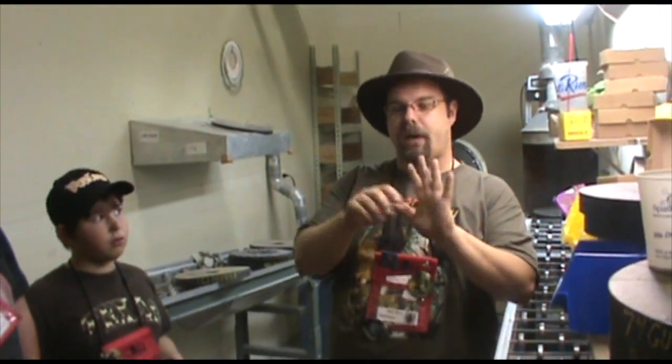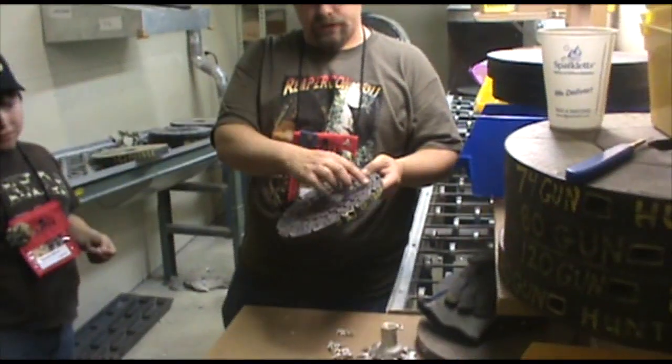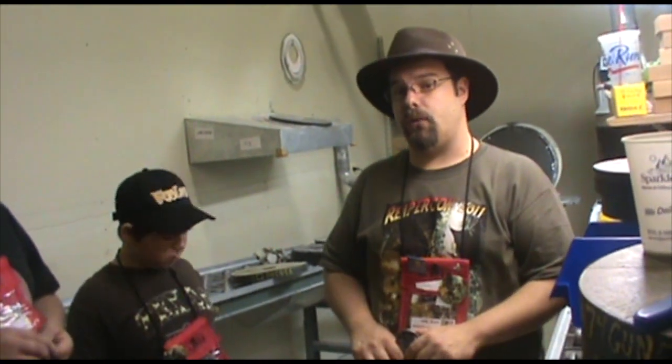He tears up those spikes every time they rip across the rubber. They put a little tear into it, and a little tear into it, and a little tear into it. And over the course of several hundred spins, they'll have successfully torn out a fairly sizable chunk of that rubber. And at that point, you'll notice that he's begun to grow what looks like broccoli on the ends of his spikes. And as soon as we see that, we go, okay, we've got to throw that mold out and make a new one. So a soft figure, I've got molds in here right now that are 20 years old.